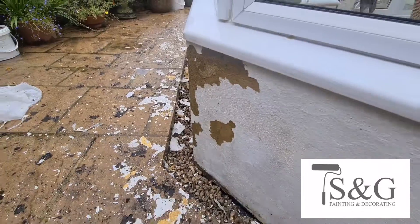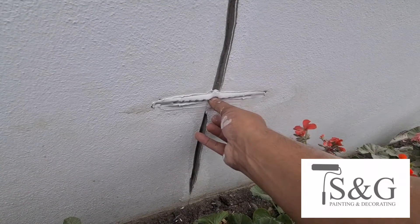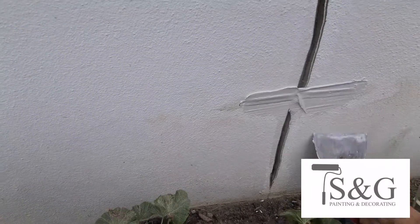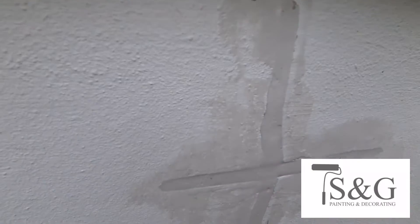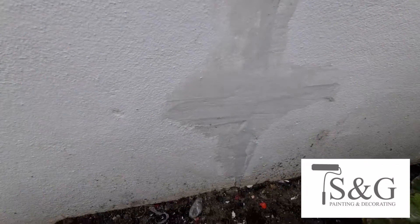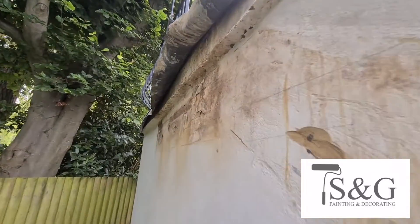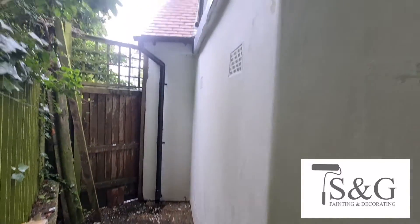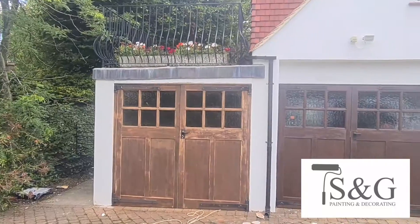Normally what we do is pull out any of the stones, make sure that any of that flaking paint comes up nice and easy. With the crack stitching, as you can see, we use the resin filler there — nice and solid. Then we go ahead with our fine fillers after that, to make sure the resin is rock solid and holds it a lot better.